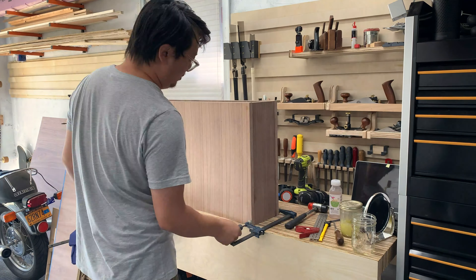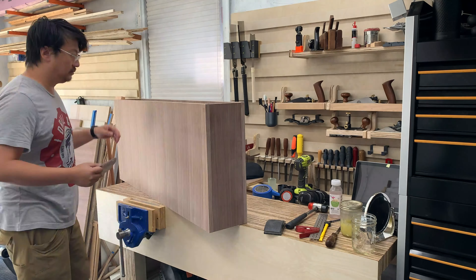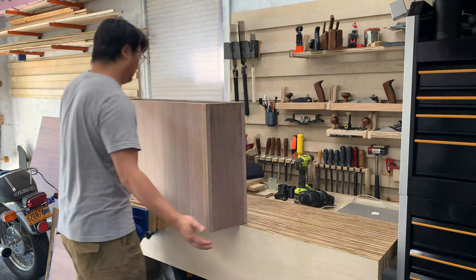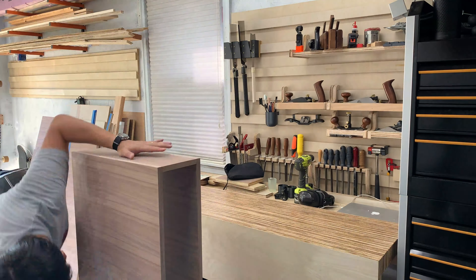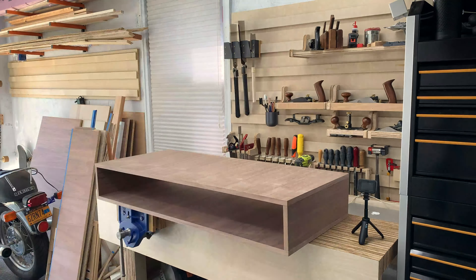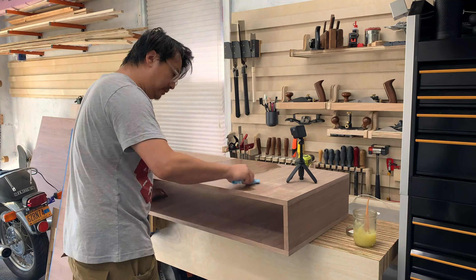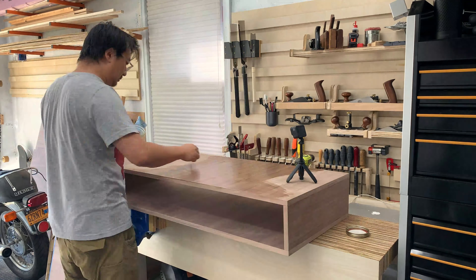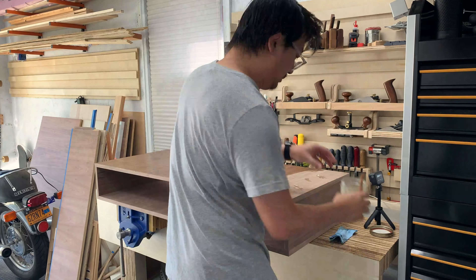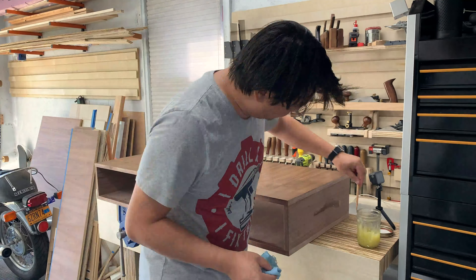Here it is the next day. I'm taking the clamps off and doing some sanding to get rid of any glue squeeze-out I might have missed, then wiping it all down and giving it a nice pass to get everything smooth. With plywood, the surface is most often already finished, so just going over it lightly with 220 grit cleans it up a little. Here I'm finishing the board by giving it a protective surface.